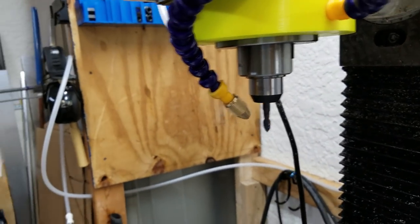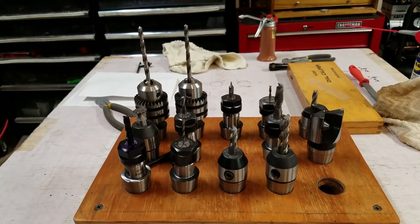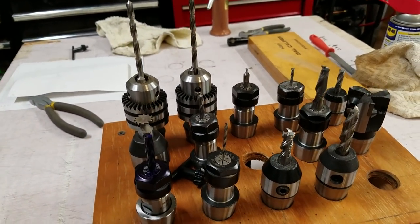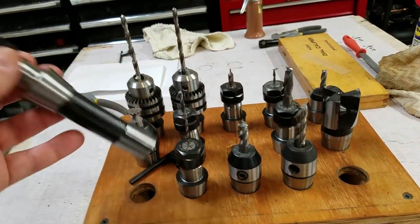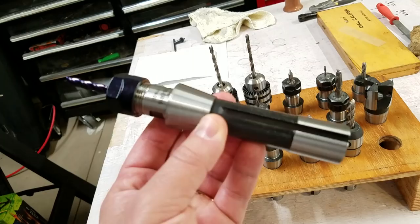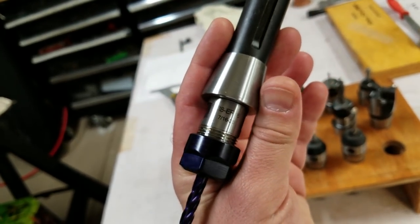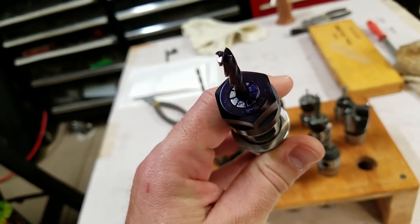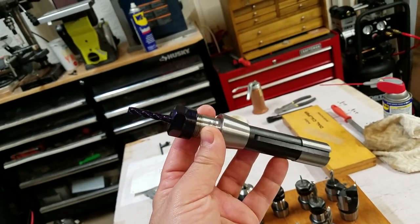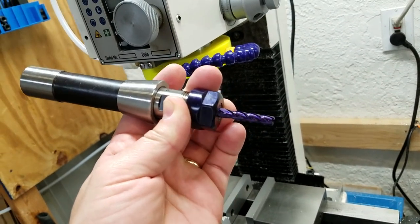I have a different solution. If you've never seen this stuff before, this will be a good video to explain it. If you've worked in machine shops, this is nothing new, but if you haven't, this is really going to help you. What these are — this is called an R8 collet chuck, and this one is an R8-ER16. It holds an ER16 collet. You put your end mill, drill, or whatever you're working with inside, lock it down, and now it's quick-change and preset. You pop it up in the spindle, draw it down, and the tip of that tool is going to be in the same place every time.